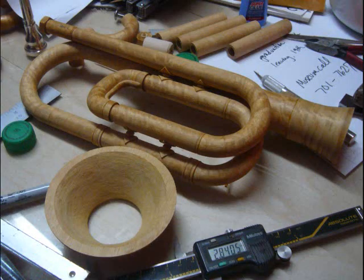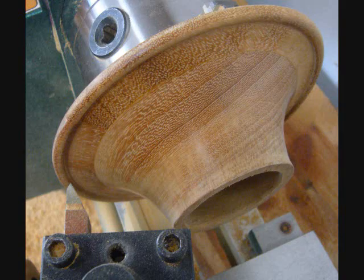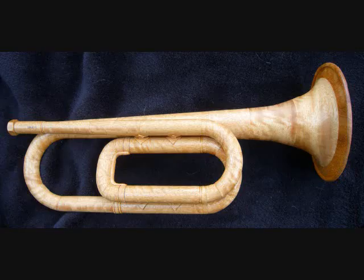And here I am checking again. Here I am final sanding it and turning the bead. It doesn't really have a function on a wooden instrument other than looking a little more authentic. When the bell is all done, I feel pretty confident that I could place it on the original Bach bell mold and it should drop right in place, plus or minus 5/1000ths of an inch here and there. Bell in place and steps ground smooth, just a few details left to go.